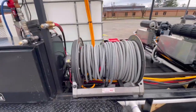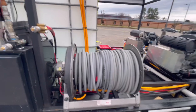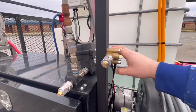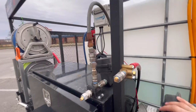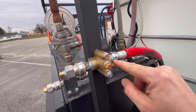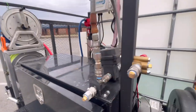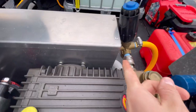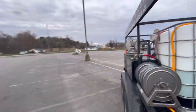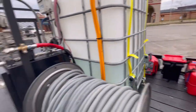We've got our 18-inch electric-rewind hose reel with 250 feet of hose — we'll probably add another 100 feet for extra reach. We've got our 10-gallon mount, which is straight for surface cleaning — no bypass, no injector. I always like to use quick connects on everything. The 8-gallon is running up here, everything's quick connected for ease of changing injectors. Even the unloaders are quick connected — both of them — in case I ever need to take them off, and the whip lines are quick connect too. I'm a firm believer in quick connects.